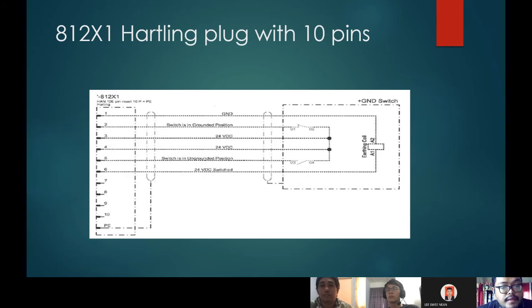A good test field has a separated ground to ensure that disturbance from the surrounding machines does not enter the test field. In case of failure, the earth potential of the surroundings does not rise and cause damage to electrical equipment. It is necessary for the test field to have a lower grounding resistance than the surrounding buildings. The following measures are required: use a ground rod, radial ground wire below the ground surface, a lightning conductor or water main outside of the building grounding.